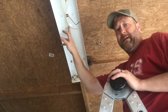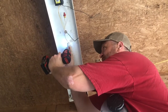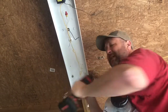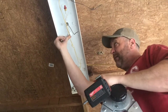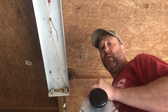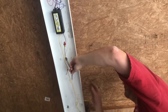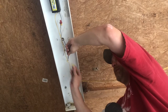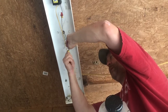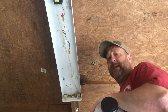I've got to find a little screw for grounding right here. I'm going to start a screw in here and wrap the ground wire around this screw until it makes contact with the screw head and the metal, and then it's grounded. Last up, we're going to make sure our hot is ready to go. I know it's off, but touching it isn't good electrical practice, so I'm not going to touch it even though I know it's off. Just make sure that little wire overhangs the big wire a little bit and tighten up that joint. That's easy - anybody can do this.